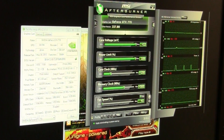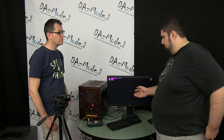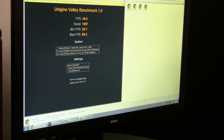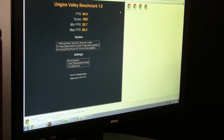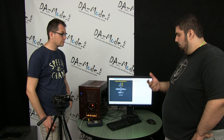I applied these overclocks — which I tested and found stable — and ran Unigine Valley benchmarks. I did four separate runs. The first run is at completely stock clocks: 1124 MHz core, 3500 MHz memory. The Unigine Valley minimum and maximum FPS are variable, but the average FPS and score remain within margin of error, so look at the average and the score. Then I tested core overclocked to the max separately, memory overclocked to the max separately, and then both together.